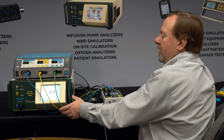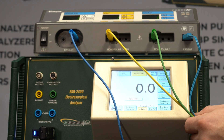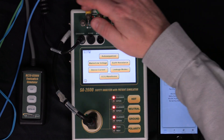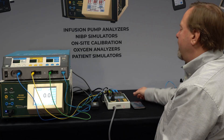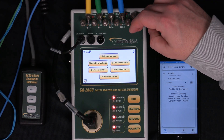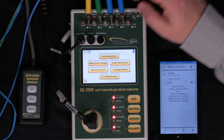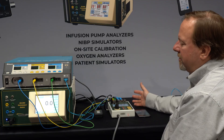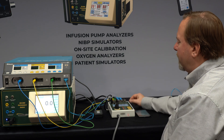Here we've got the generator connected. All of the mains to applied parts are connected to all of my electrodes on the 2600. It really doesn't matter what sequence these are plugged into. There are labelings on the 2600 for ECG leads, but none of these are ECG leads, so all we have to do is measure the leakage to each one of these.